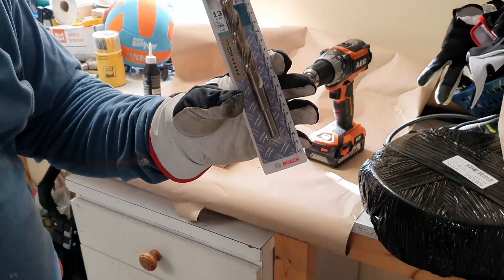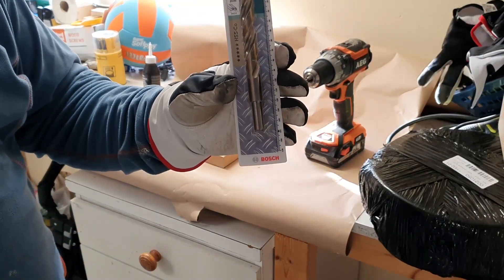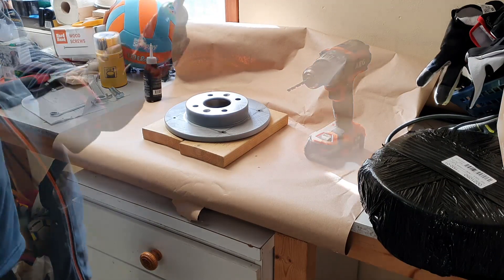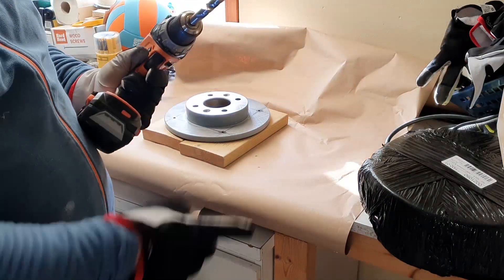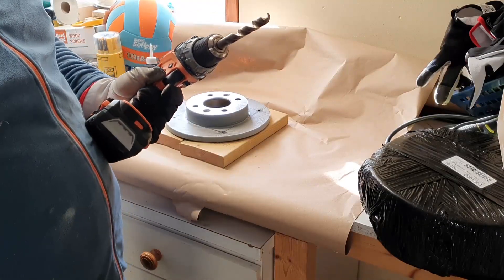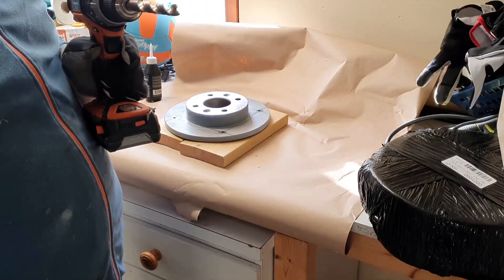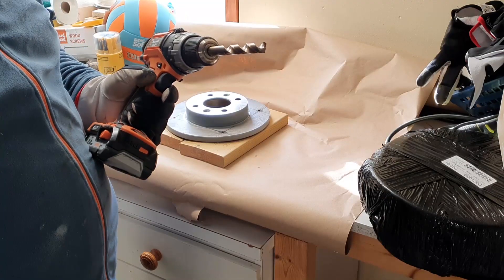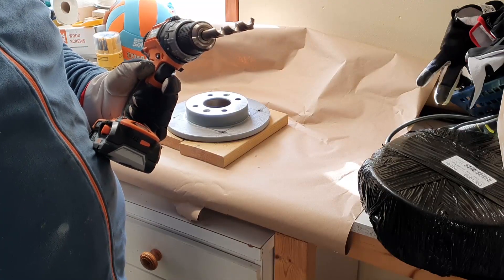Time to level up in drill size. When drilling this type of material you really need a hardened drill bit. If you purchase the cheap one, that will go dull in about 10 seconds and then you won't get any deeper whatsoever.